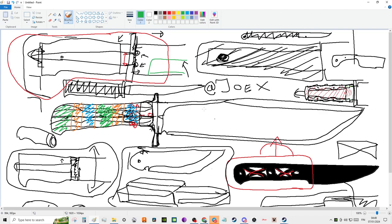And a lot of these things, especially with these bigger bowies, it comes down a lot to your steel choices, because some steels are much more brittle than others, and that's when that front pinhole right here really makes a difference on how strong your overall blade construction is.